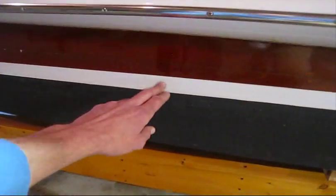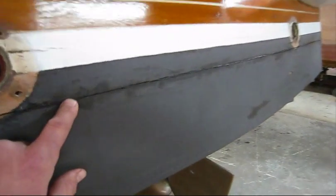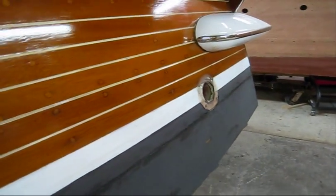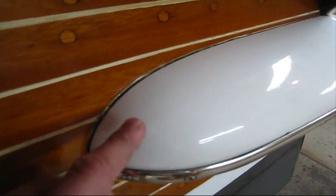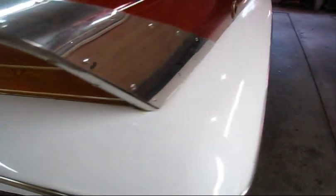I'll show you what type of paint I'll use and how to tape that waterline off to get it nice and crisp again — you can see there are areas where it's kind of fuzzy. For the bottom paint, I'll show you how to prepare that, scrape and sand it, and feather it in. I'll show you what type of bottom paint I use and how many coats. There's a plank on the back of the transom and a lower transom plank that has a gap in it — I'll show you what type of caulk to use to flatten that out. There's also an area where the fiberglass feature meets the transom with a big gap, and I'll show you how to tape and caulk that to make it look nice and crisp.